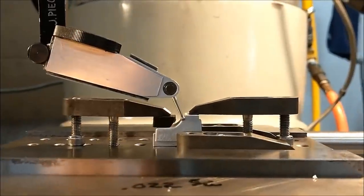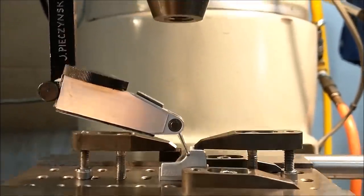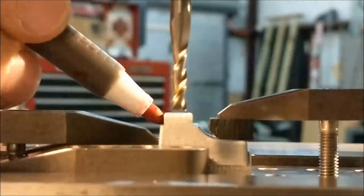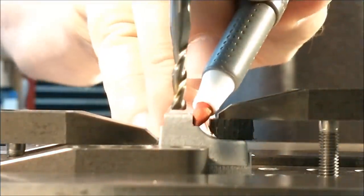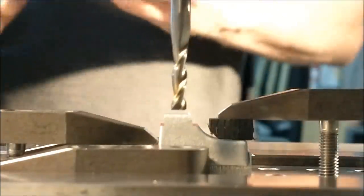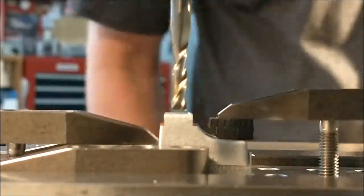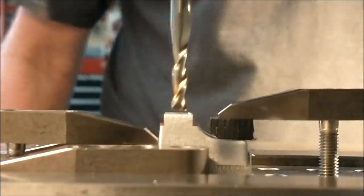I'll put the camera right behind the part just like this, because that's a great camera angle, and we'll get this done. Oh, fussy little part. This is the surface that I'll mill down to. Go about 3 beyond. So it's really helpful to know how thick this part is before you start. I'm going to deck the top off with the same cutter I'm going to make the slot in the top with, just to save time.